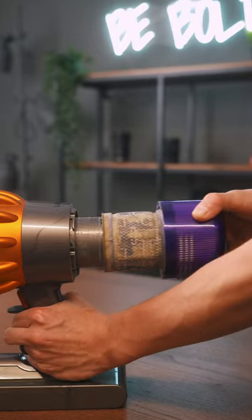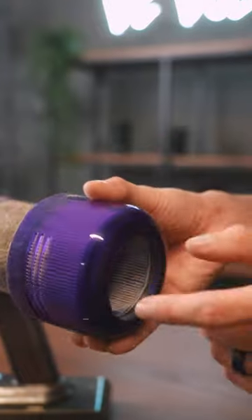But not with us — we took a closer look at how this filter system works and found a solution that basically allows us to use this filter forever. The system uses two filters that need to be flushed out in opposite directions. Makes sense, right? If it sucks in this way, I have to rinse it out the other direction to get all the particles.